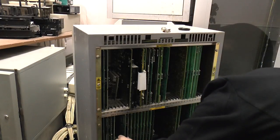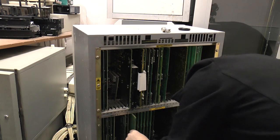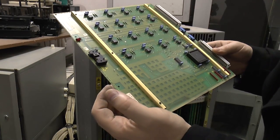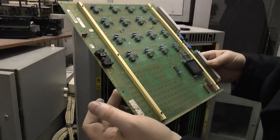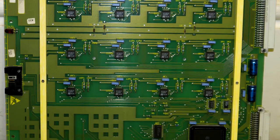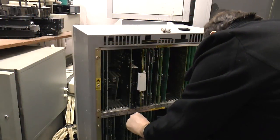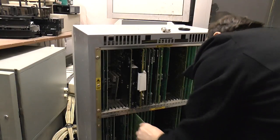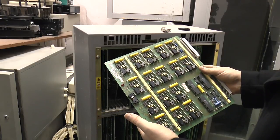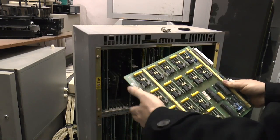Next up we have the shelf interface. Then a 16-channel codec card — quite smart and quite sparse. Chip codes on here are 9138 and 9125, so middle of 1991. It's a 16-channel codec card with HF12911As — funnily enough, 16 of them. For every one of these codec cards there is also a 16-channel extension interface. So the two cards run together, and each pair will represent 16 extensions coming into the system.